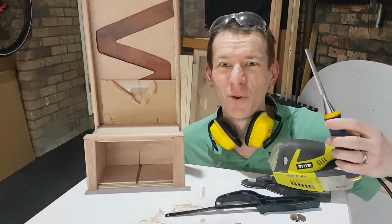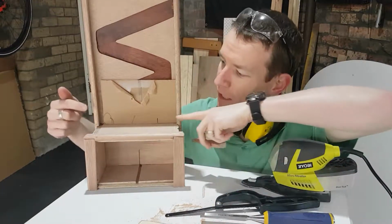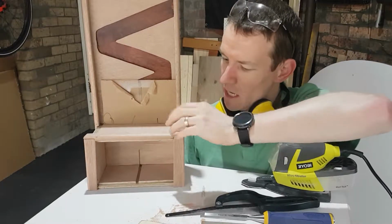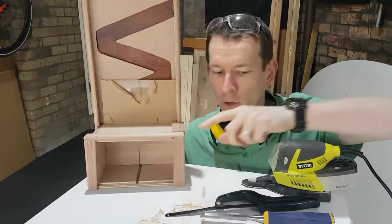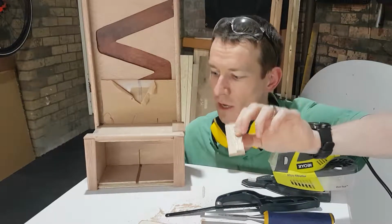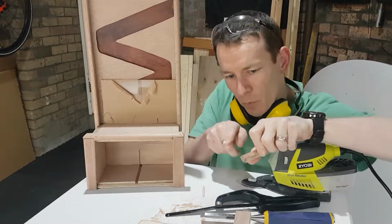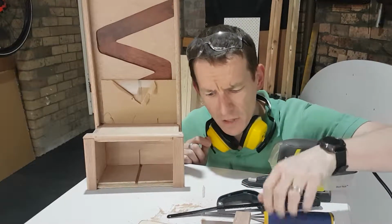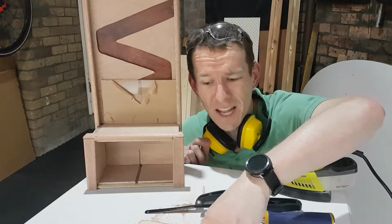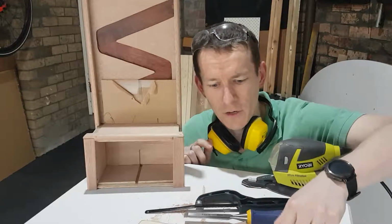Ah, hand tools. Needed them though. I'm now cutting these 2 side bits, which I want to L shape in like that, and then I will round off these edges too. So I had another one of my U shapes, which I've cut off just like I did previously to make the L, but this little cut here was so delicate, I decided I'd do it with a hacksaw instead of trying to do it on my fairly rough as gut inverted jigsaw. A little bit of chisel work as well, just to make it fit nicely.